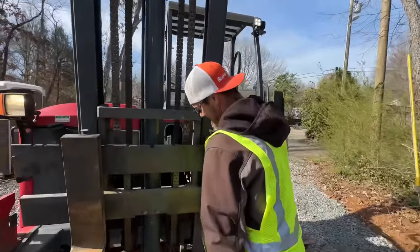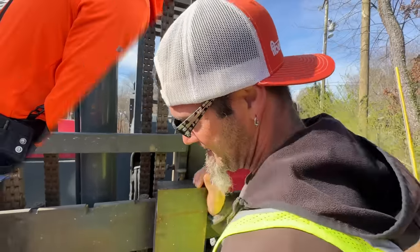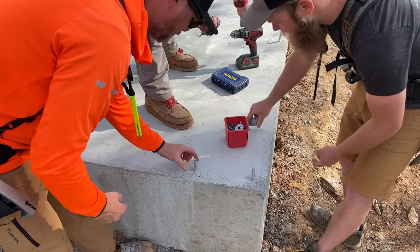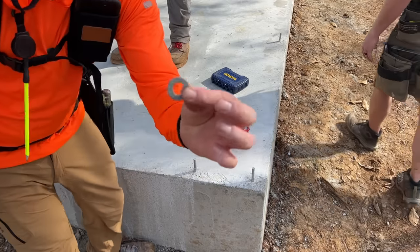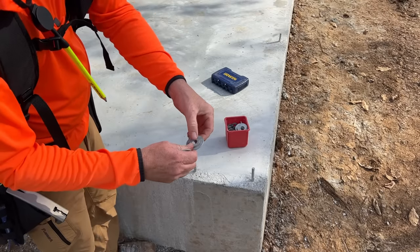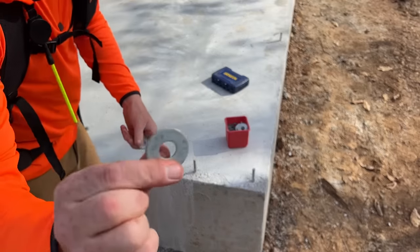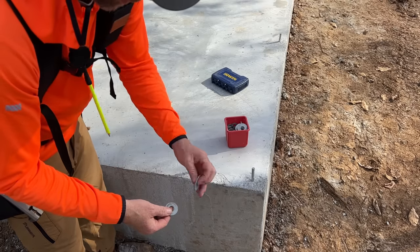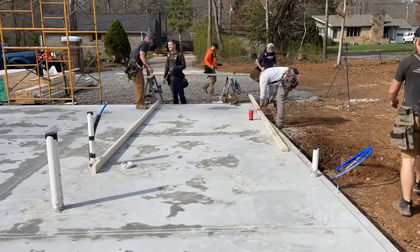John's here. We're checking out our washer situation for the anchor bolts. I want to drill a three-quarter inch hole to get a little wiggle room to align the plates flush. But with that washer size it would go right through the hole, so I'm going to double-washer it — use a giant washer and drill a slightly larger hole. Base your hole size on your washer size. You don't want the washer to sink through, but a little bigger hole gives you wiggle room.